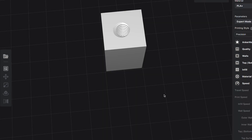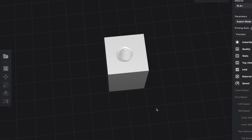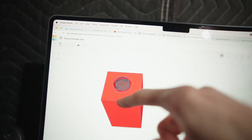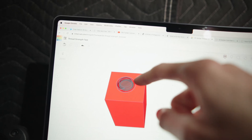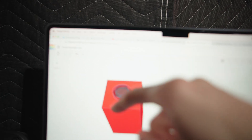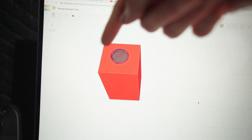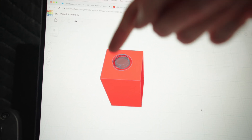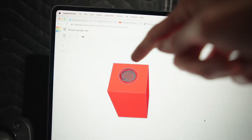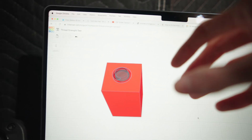I quickly designed a little box with a quarter-20 thread that goes all the way through it, and I made sure there was enough room around the thread itself that it wouldn't just attach to the walls — there's still going to be infill all around it. In the pieces I'm actually printing, the threads will be in the center, surrounded by infill rather than right by the walls. Strength-wise, this should be a pretty good representation of the pieces I'm going to print.